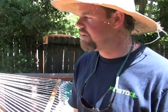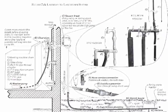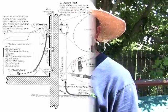Green Goods — we're local here in San Luis Obispo. We have a laundry and landscaping kit. It comes with a three-way valve, an air relief valve, a couple tees, a couple of elbows, 20 feet of purple pipe, and some miscellaneous materials that you need. In most cities in California you can do this without a permit, but look into your local building code to find out.